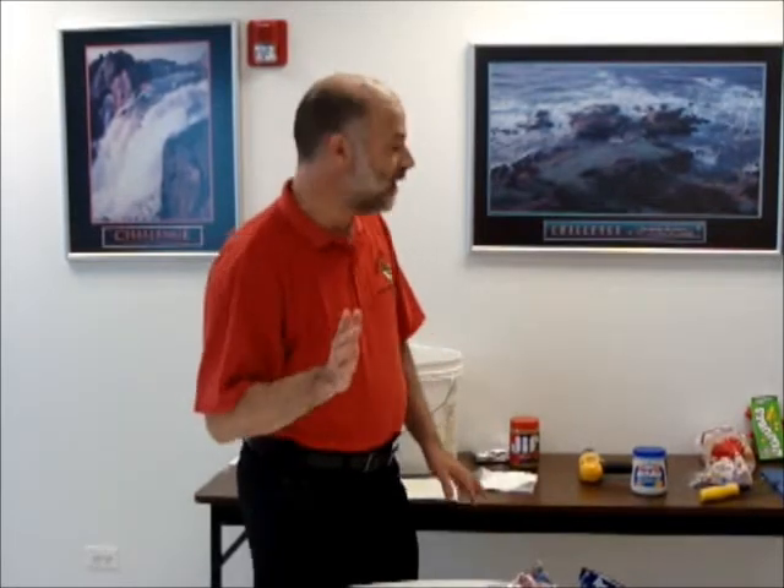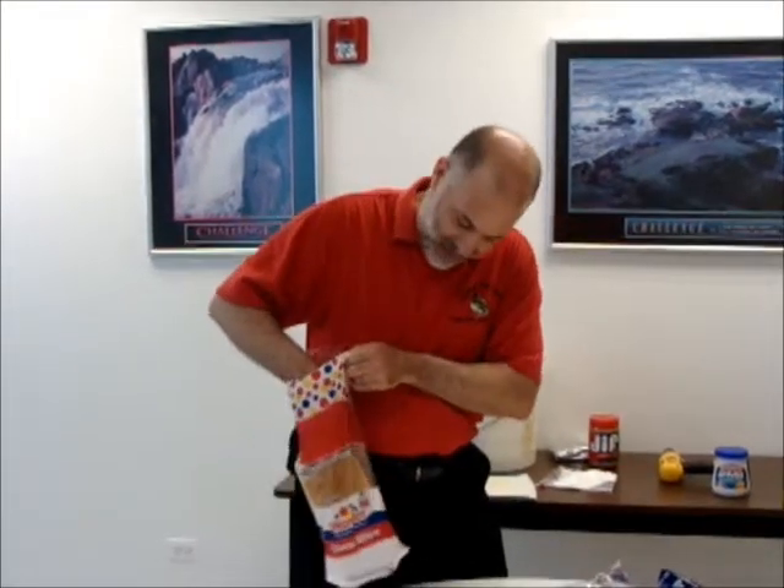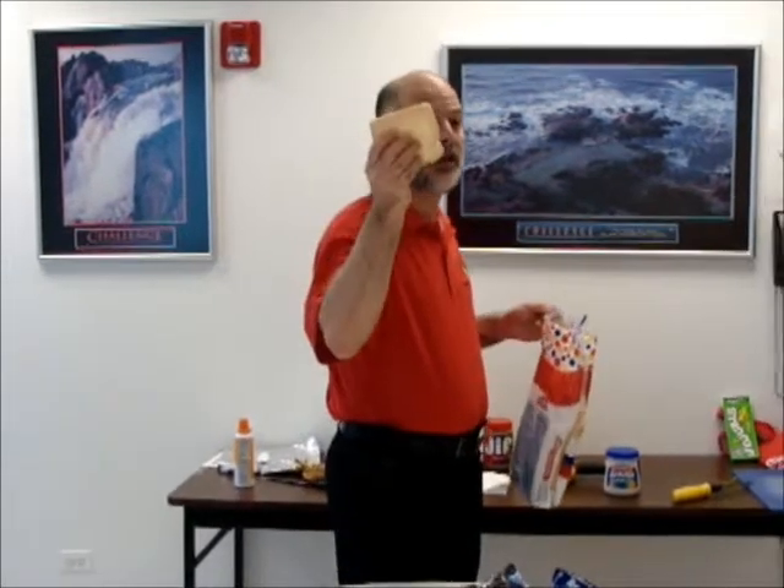Now you've got to have fiberglass. The basic structural portion of the circuit board is fiberglass. We don't have any fiberglass here, so we're going to use Wonder Bread — here is our fiberglass. It gives structure as well as electrical isolation, so it's our insulator. Now, resin also provides some very important function: moisture resistance, electrical resistance, and some rigidity. So we now need some resin — it's epoxy. If you look at an epoxy glass copper clad laminator, it's very much similar to what they make boats from.